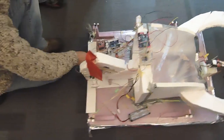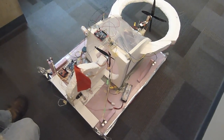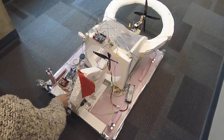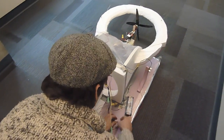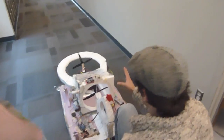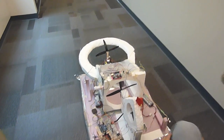To make things simple, we put in this potentiometer so we can control the speed of the thrust. This is a semi-autonomous hovercraft. There's the obvious problem of detecting non-motion, so we've decided to use human intervention to detect non-motion. We're going to power it up and follow this wall on the right, and demo the wall-following state rather than searching and switching walls.